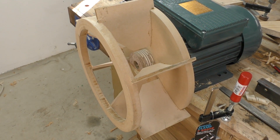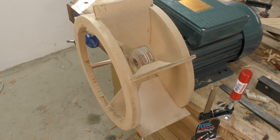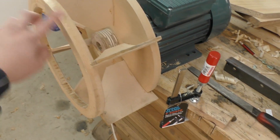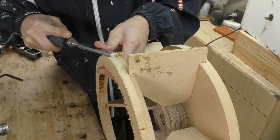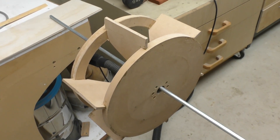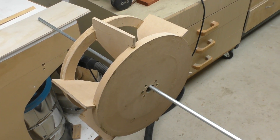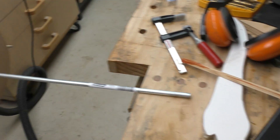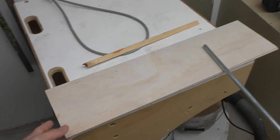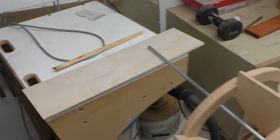In a previous video I turned the outer ring of the impeller nice and true, and now I just have to clean up some of the spots here. I've set up my impeller on a steel rod to balance it, and the steel rod rests on my workbench and on my vacuum cleaner station thingy-majig. I've shimmed it a little bit higher so that they are perfectly level.